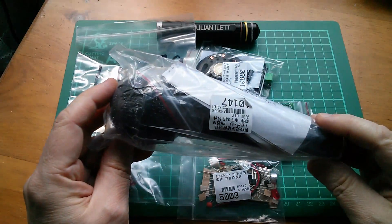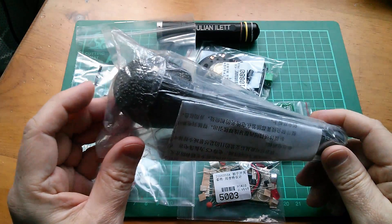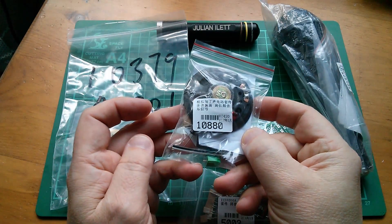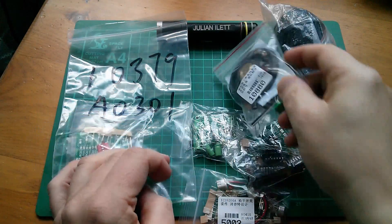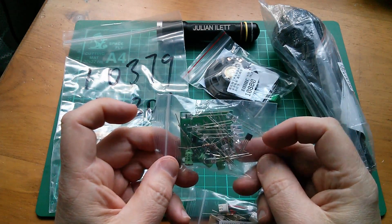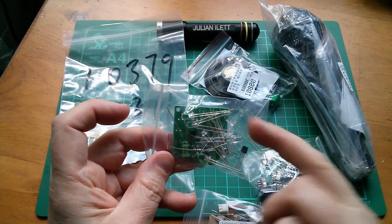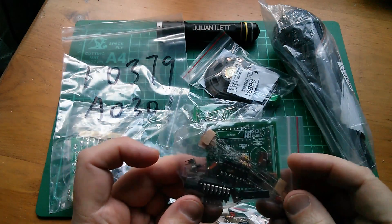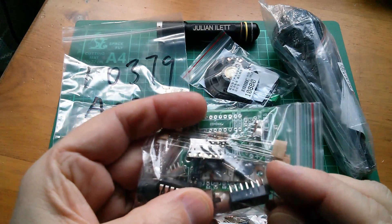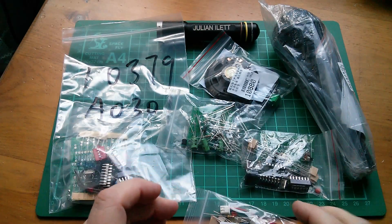Including this microphone, which I believe is an FM microphone — you put a battery in here, speak into it, and it comes out of your FM radio. Now there's a kit here with a quite large speaker in it. I can't quite remember what that is, but it's obviously going to make a noise. Unless it's using it as a microphone. Here's one with LEDs, three transistors and three capacitors. Pretty sure that's a ring oscillator which lights up LEDs in a circle — that's quite fun. This I think is the 16 sound effects unit. Yes, there's the little blob chip sound effects generator there, and I think the rest of the circuitry is for selecting sounds and switching them.